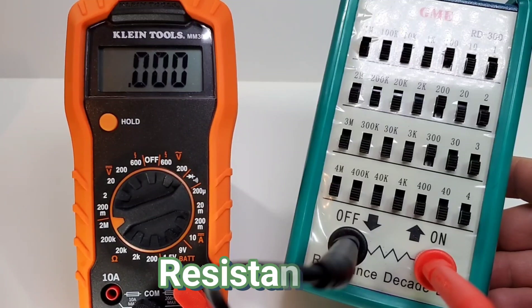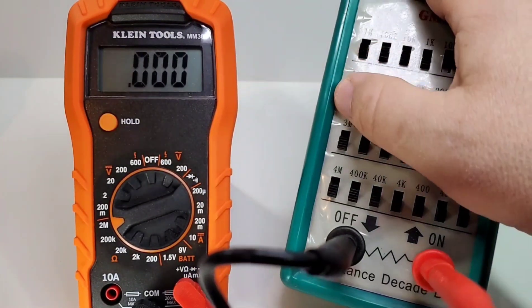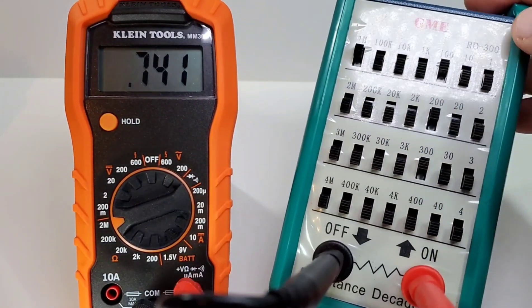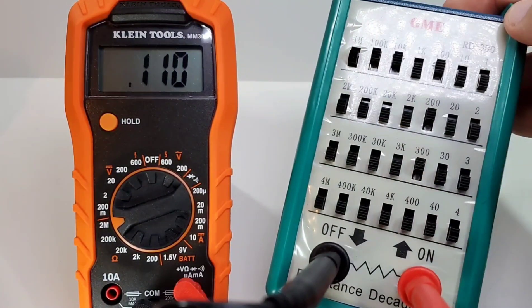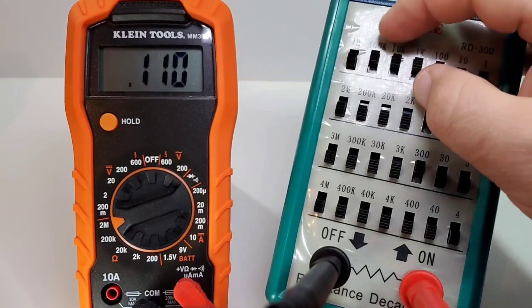Quick look at resistance — I wasn't going to bother given the paltry 2-megaohm range, but let's see. At 2 megaohms it is very slow to settle — incredibly slow. At 1 megaohm, same story — incredibly slow. At 110k it's a little better, reading 111k. At 500k it's still slow, but a bit faster on the lower settings.